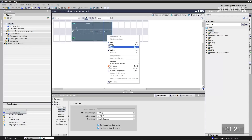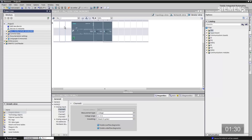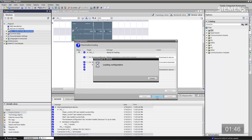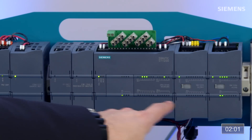What if we want to change an attribute of this hardware? Let me right-click on this analog card and click properties. You can see I have plus or minus 10 volt for this analog card — I'm going to choose plus or minus 5 volt. I'm going to give focus to the CPU and click download. So now I'm taking the physical hardware configuration, including attribute changes, and downloading to the actual hardware set so it's an operational piece of hardware. It's compiling in the project. I click load — now it's actually loading to the actual CPU itself. Once it's finished loading, I can click the finish button, click start all, click finished, and now we should have a set of all green LEDs for this piece of hardware.